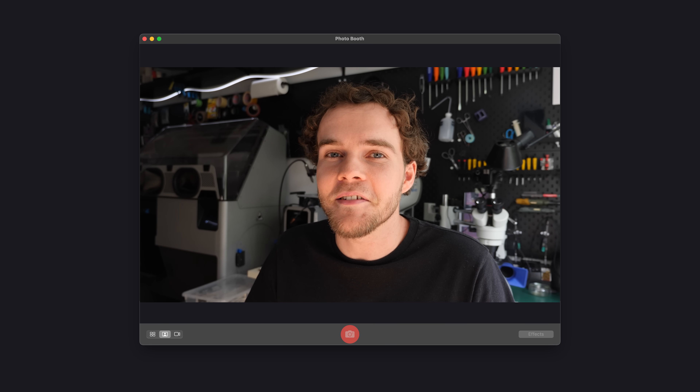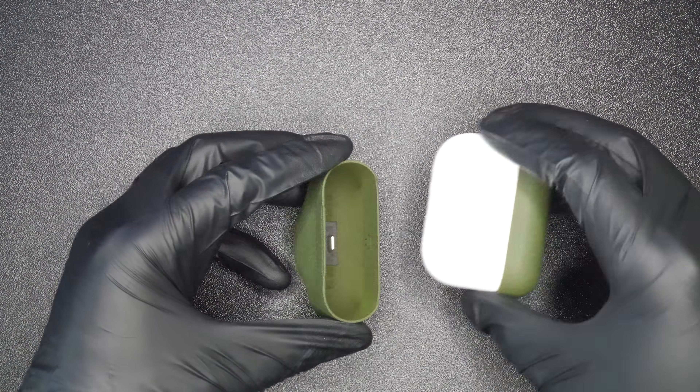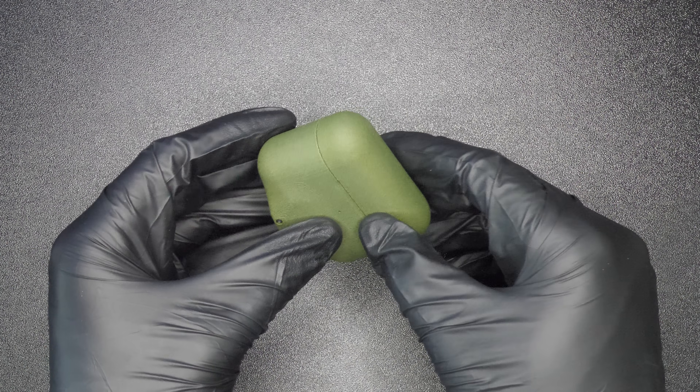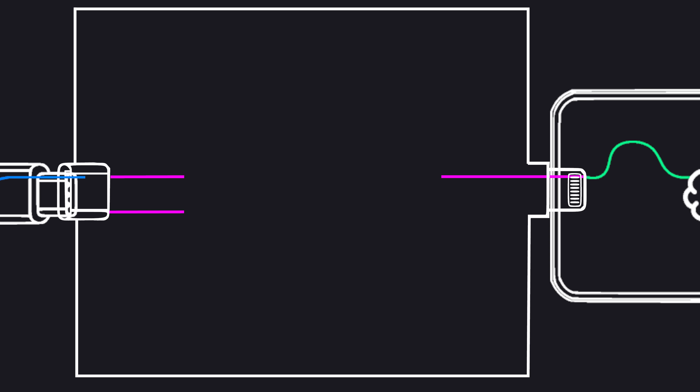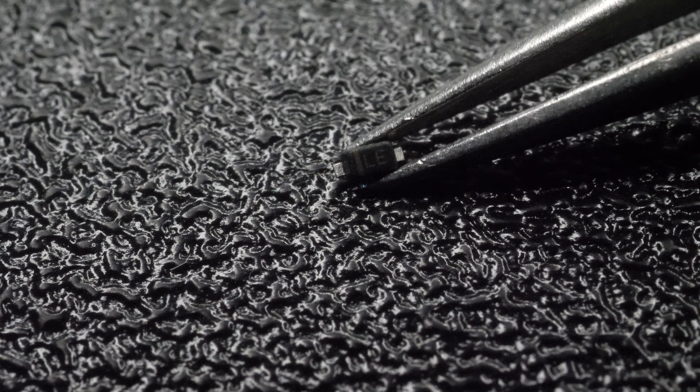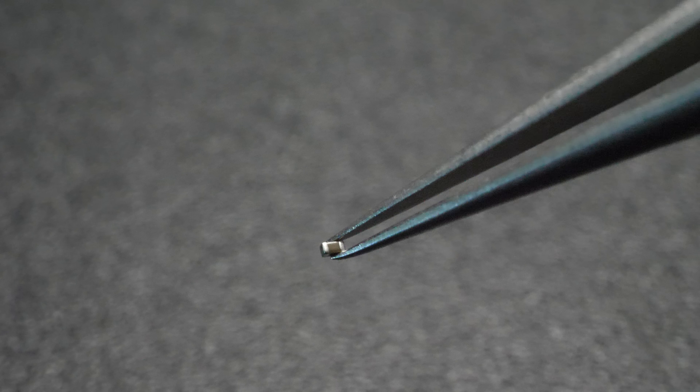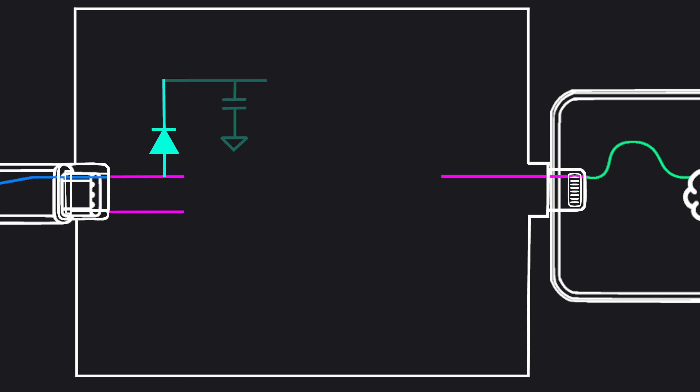It's a little meta and I really love it. You know how these cases I'm making are kind of like parasites — they latch onto the device and do something they aren't supposed to. So here we're going to use a trick called parasitic powering. We have a CC line from the cable and it's got power — we just need to steal some. So we connect a Schottky diode to it. That makes it so the current can only go one way and ensures we don't affect the CC signal. Now we've got this current, we need to store and stabilize it, so we add a capacitor. And we do the same thing on the CC2 pin.